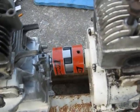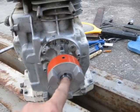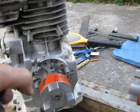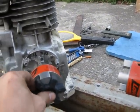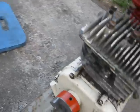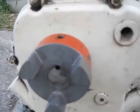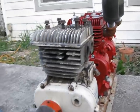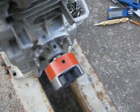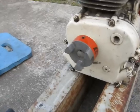The problem with the Lovejoy — I'll show you here — the keyway only goes in one way. So I need crankshafts that are 180 degrees apart. Because I've machined all the crankshafts so that the key is basically in line — the key at the back of the engine, when it's up, the key at the front of the engine is up. So the Lovejoys will only work on pistons that are 180 degrees out of phase.